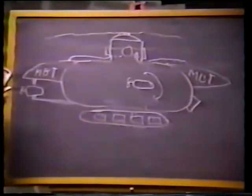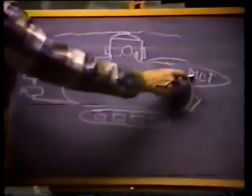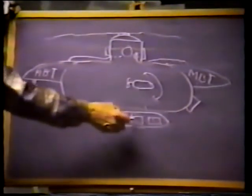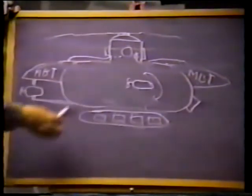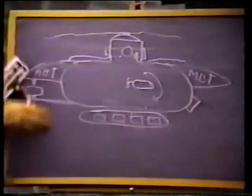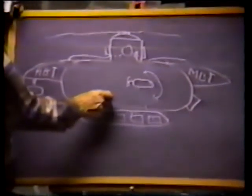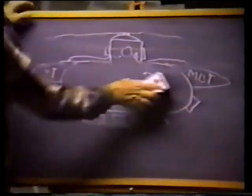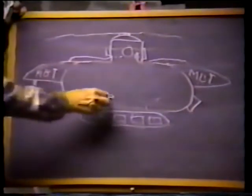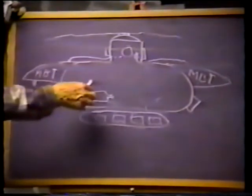What do we have for safety features? You can blow the forward main ballast tank — that'll get you to the surface. You can blow the after main ballast tank — that'll get you to the surface. You can blow the variable ballast tank — that'll get you to the surface. You can point the motors upward if you're at neutral buoyancy and that'll get you to the surface. The high-pressure air comes from two scuba tanks located inside the submarine — one kept lined up on the high-pressure system of the submarine, and the other kept with a scuba regulator.